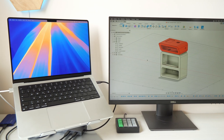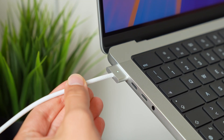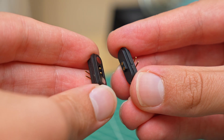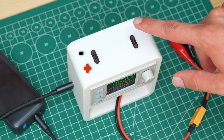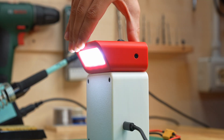The last thing we need is a way to power the lamp. Here I found the inspiration on my desk: the Apple MagSafe connector. Using simple magnets it keeps the connector in place while creating an electrical connection. Adopting a system like this to mount the lamp would really take the project to the next level. On Aliexpress I found magnetic connectors which are well made and designed so that it is impossible to reverse polarity. To mount the lamp I will use two pairs oriented in opposite directions, so that the lamp can be mounted either forwards or backwards.